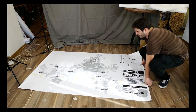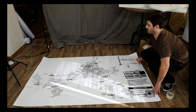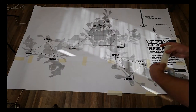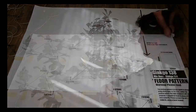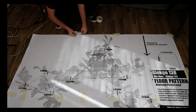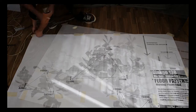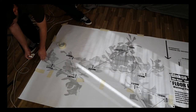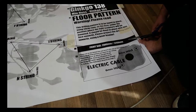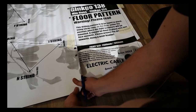Paying attention to the desired orientation of the lamp in your environment, using the silhouette drawn on the drilling pattern, place the drilling pattern on the ground under the position where the light sculpture will be installed and fix it in place using tape. Be very careful that it stays straight according to the position you have chosen. In one of the corners of the pattern you will find the rectangular area with the drilling pattern of the ceiling adaptation piece. Please cut that away from the pattern and place it in the circle indicated in the middle of the drilling pattern.